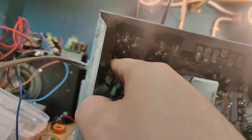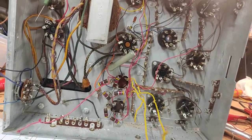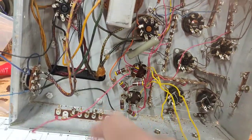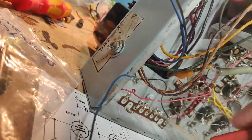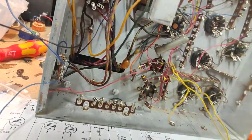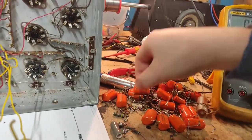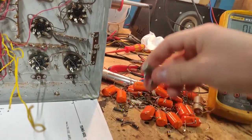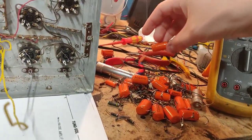Here I'm going to add a resistor to the screen grid, because there was one there and it was burned so I removed it. There is a ground wire going over here — remove it. I'm trying to remove as much as possible to try and clean this up a little bit. I'm not going to be reusing any of these resistors because they are all drift-o-matics. I'm probably going to reuse a bunch of these orange drops — there is nothing particularly wrong with any of those.